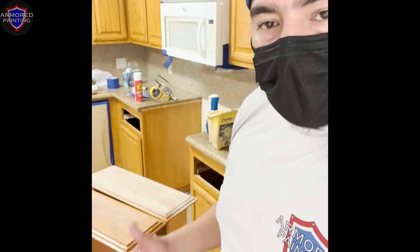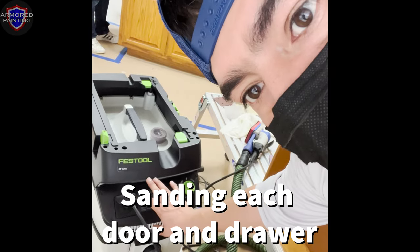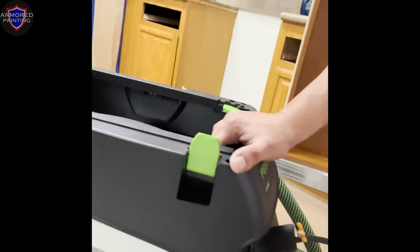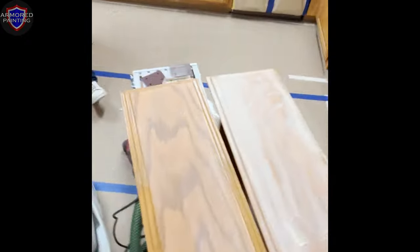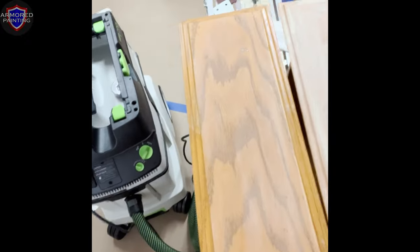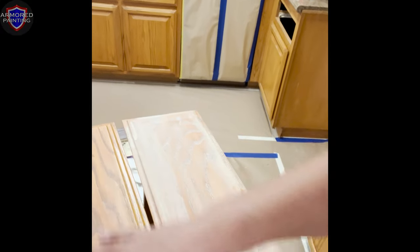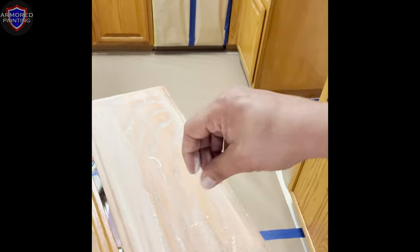What's going on, guys? I just want to show you guys real quick this Festool dust extractor that we invested in to make these jobs a lot faster. This is a HEPA dust extractor. So you guys can see the difference here when sanding with and without. You can see here, this leaves little dust behind, and you can see what happens when you don't use a dust extractor. So this leaves the job site a lot cleaner, and we don't have dust going into the air,